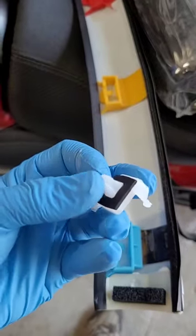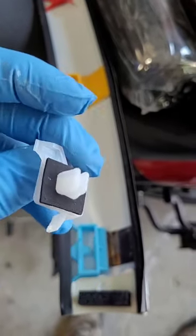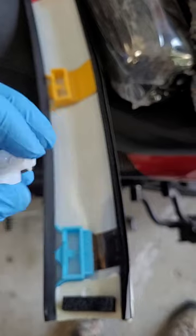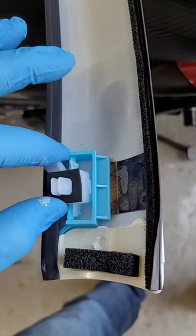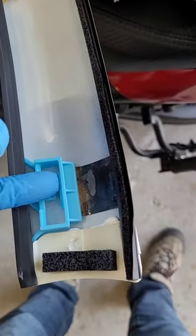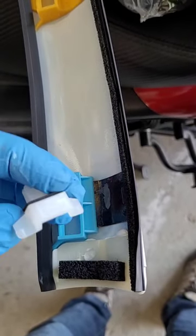Here's what the clip looks like. It's a solid piece and that gasket makes a waterproof seal against the square opening on the roof, so it has to maintain water tightness. The way it goes in when attached to the roof, it has these little wings that push against it and a lip underneath that clips into this piece. As you get it in place and push it down, it'll lock itself in.